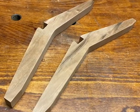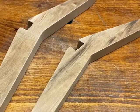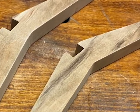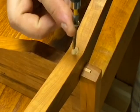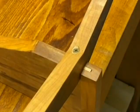The two feet raise the support slightly and add the necessary stability so that it stands on its own. I cut a three quarter inch recess in each of the feet to match the profile of the bottom support. I attached the feet to the bottom of the barrier with glue and screws — I thought screws would give additional support.